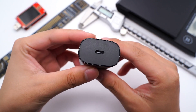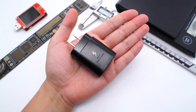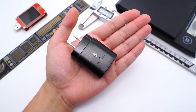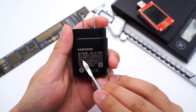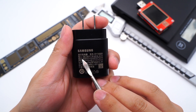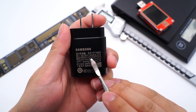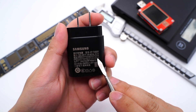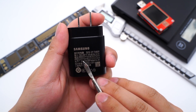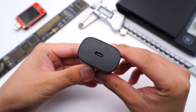What we get is a black charger with fire retardant PC case. The front continues Samsung's design — super fast charging. It supports input of 100-240V, 50-60Hz, 0.7A. And output of 5V 3A, 9V 2.77A, 3.3-5.9V 3A, and 3.3-11V 2.25A. It adopts fixed pins and USB-C is at the bottom.